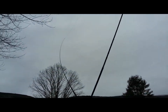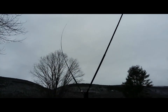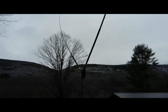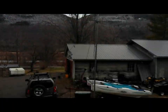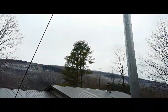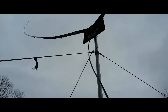There is no contest between a full wave loop and a dipole. Don't believe all the stuff you read online — they're two to four S-units quieter and they just work. That's it — great field day antenna. Takes about 10 to 15 minutes to set up at the most. For a very effective antenna, full wave loop freestanding — you can even drop this on a pole on the back of a vehicle.